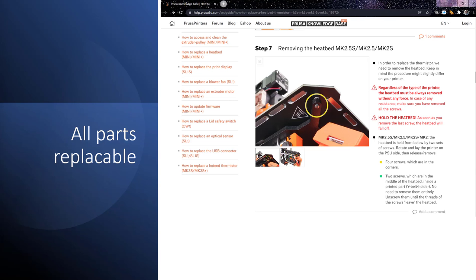The beautiful thing is almost everything on the Prusa printer can be swapped out — it's a kit. Everything can be 3D printed or ordered. If it's an aluminum part it can be ordered; if it's a casing or housing it can be 3D printed. If you're going to print parts, I recommend using PETG because it's stronger and will wear and tear more tolerably. The only thing you really can't get into and replace is the power supply — you replace the whole power supply, not subcomponents, because you get into some danger with capacitance and voltage. But those are pretty reliable systems.